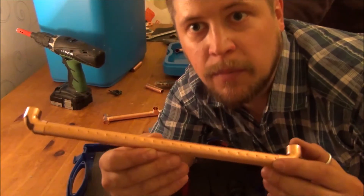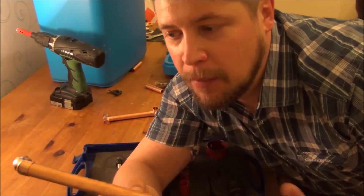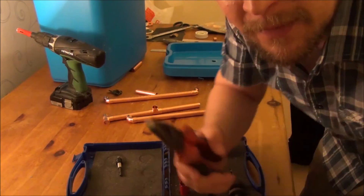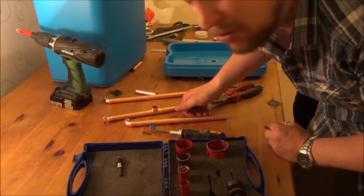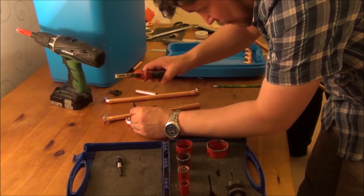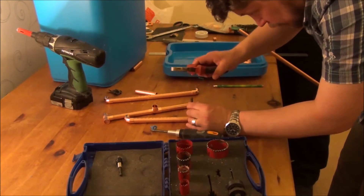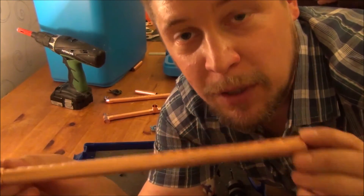So I've just marked out on this piece of sparge arm where the holes are going to go — marked at about centimetre increments, going to use one millimetre holes, and I've just punched them. Being as this is the Bob Shop, I'll show you how I've done that: a nasty old screwdriver bit and a pair of pliers, because when we're working in the Bob Shop we use whatever we've got to hand as long as it's not horribly dangerous. Misuse of tools is very good. And there we go — a lovely set of indentations ready to be drilled, Bob Shop style.